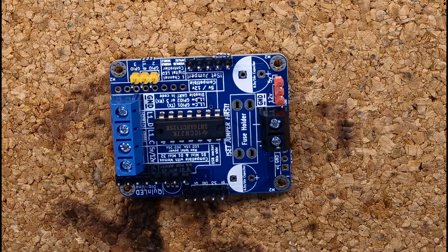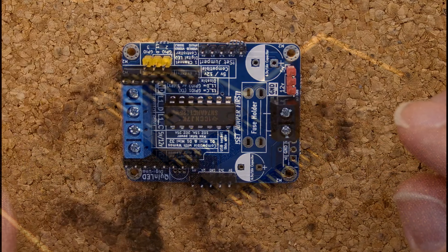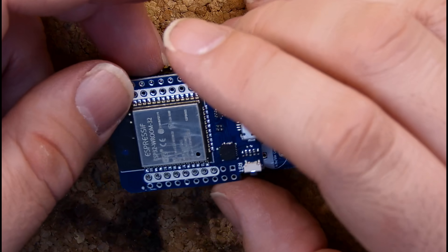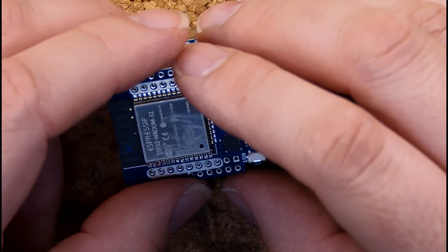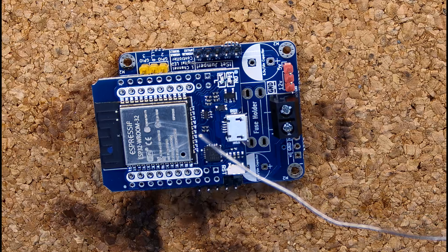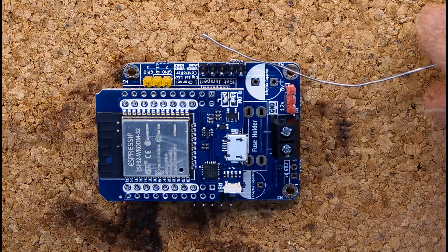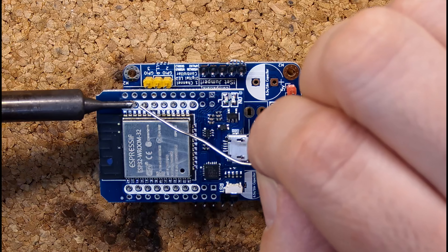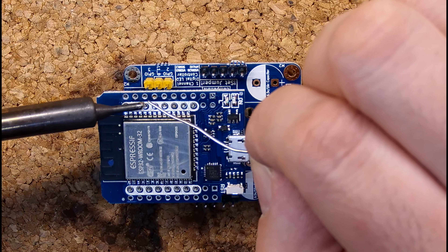With the input terminals done, we're going to solder on the standoffs and the ESP8266 or ESP32 you're going to use. I like to do this in a sandwich way, where you take the female headers you solder to the board and the pin headers you solder to the microcontroller and insert those together, then add the microcontroller on top. By doing this, it auto-aligns all those components. You solder the pin headers to the ESP module and then the female headers to the bottom of the board, and it automatically solders straight and fits together.